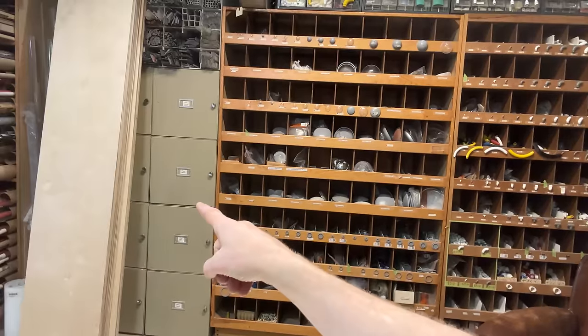There's my plywood. Our local lumberyard is having a sale on this birch face ply. The interior is a horror show. Oh God, look at this. I'm sure there's like clothing and animal parts in there or something, who knows? Don't ever put wood like that into your laser cutter. When plywood has voids in it, those voids create pockets where hot gas can build up and set your laser cutter on fire. So I've got the plywood, I've got the drawer slides, the aluminum is on order.